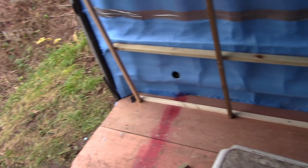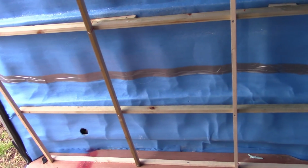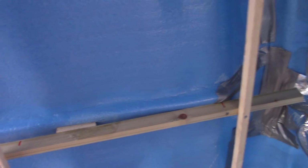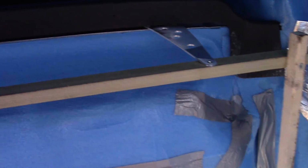The bulkhead is now battened out. It's fairly straightforward. Batten going into the floor at the bottom there, and two that we were able to screw directly into the stiffener on the bulkhead. I don't know if you can notice, but this has received a bit of an impact from whatever load they were carrying, so it's not exactly straight. And then at the top, some more light alloy brackets with holes in them to make them even lighter, you know, and less conductive as well, I should add.